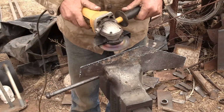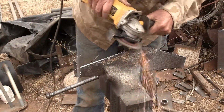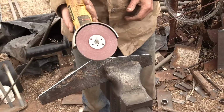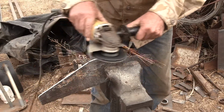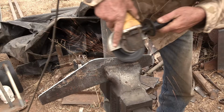The first thing is to use an angle grinder with a metal grinding disc on it. Get it kind of flat and smooth. Then grab a similar tool with a fine sanding disc on it and continue on to smooth out the edge of this truss, making sure to really get all the razor sharp corners off. Round them all off.